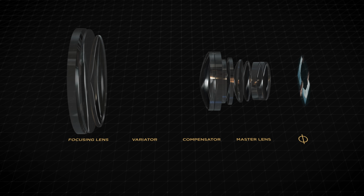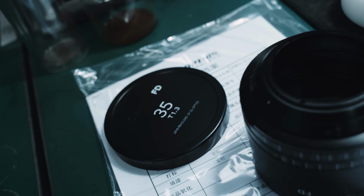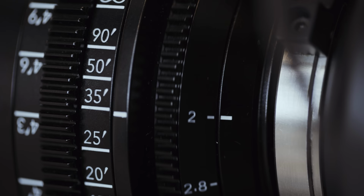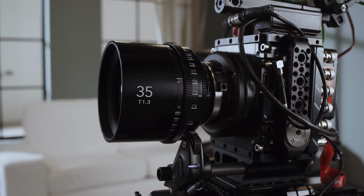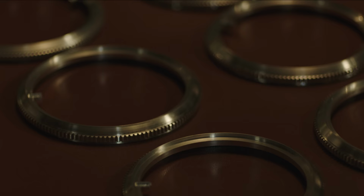Rehousing doesn't change the optical design of a lens. A lens that is not corrected for breathing by design will breathe after rehousing, but hand collimating can reduce it in some cases. As mentioned in the intro, GL Optics does offer modifications to optical designs to be able to offer wider focal length in an otherwise incomplete or inconsistent set. More about that later.